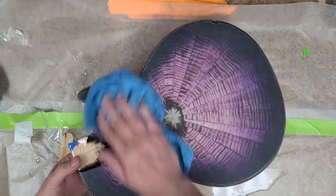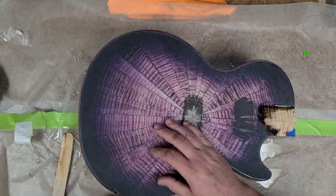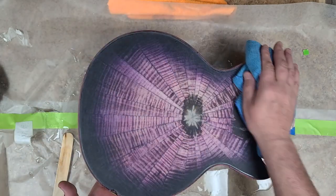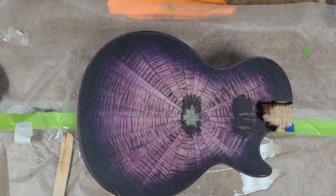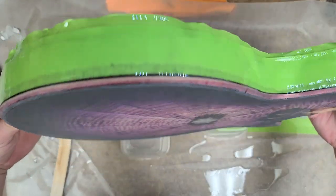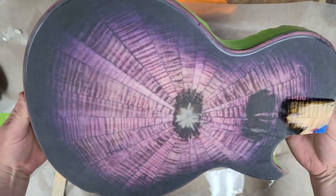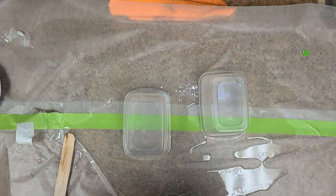So right now I'm just getting ready to put the final coat of epoxy resin on this thing. And with this sander, as long as you don't dig in or apply too much pressure on one side of it and you just lay it flat, you'll get a real nice flat, like dead flat, top on whatever you're trying to sand for your surface.